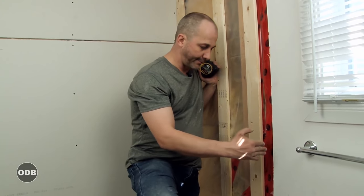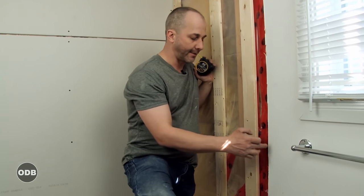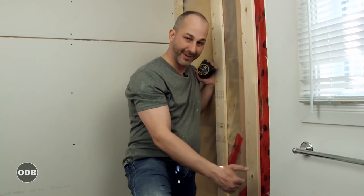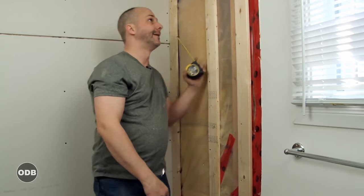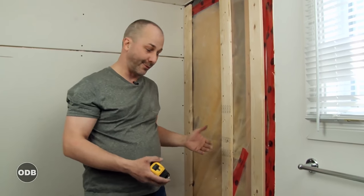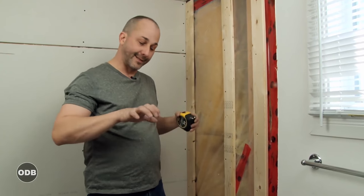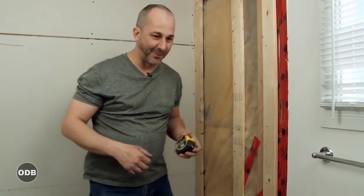And by doing that, it'll give me a natural end to my tile. And I can actually just caulk that with the old drywall and then finish paint right on top of that metal. So there's no mud work or anything like that to be done. The trick here is I have to cut this one piece of drywall out of one piece, no joints. Attach that J trim and then install it all as one piece. So the measurements have got to be pretty exact this time.